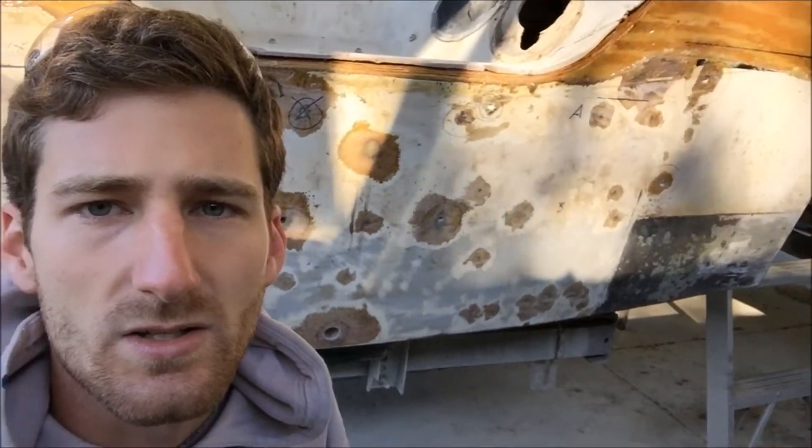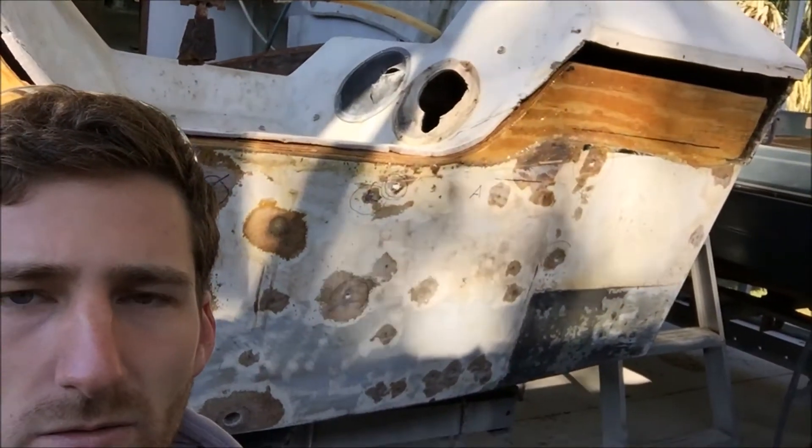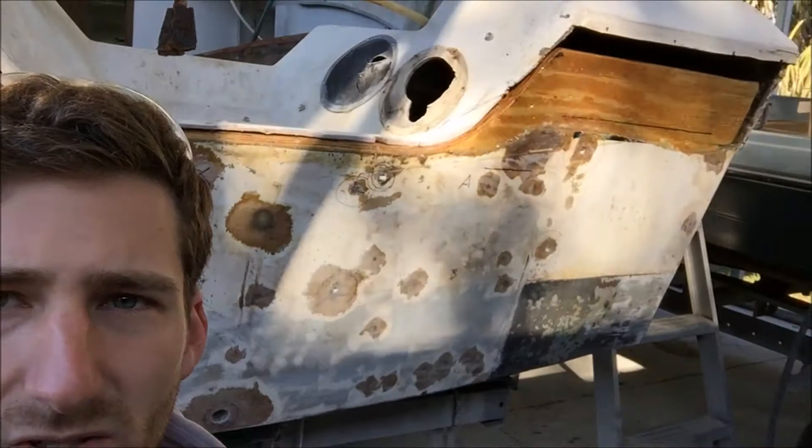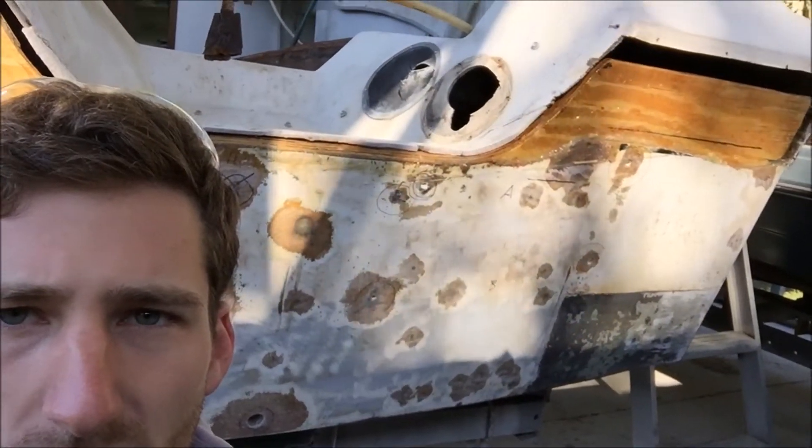I got the fillets done, and I also got two layers of 1708 done on the sides and the bottom. I still have to go up there and fix that massive hole in the fiberglass, cover up the wood, and seal it all up - I'll probably start working on that today. I also got my drain plug hole drilled. I'm putting a new Garber drain in there - I already have that and got the hole drilled. Let me get inside the boat and I'll show you the tabbing.